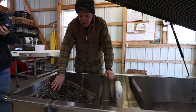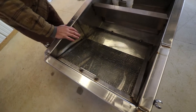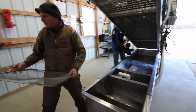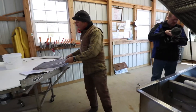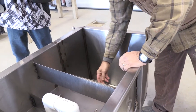They've engineered some screen systems in here and what I call weirs — basically small dams — to trap sediment. The pump at the bottom will pick up the water and draw it back up and spray the crops in a pre-soaking mode. It has this larger screen here that captures bigger things. Down here is a smaller mesh screen, all stainless steel, and this is where the pump would draw the water in. This is the drain port here, and then it has these — kind of dams.